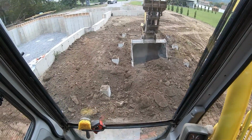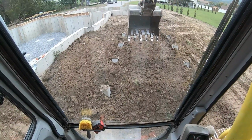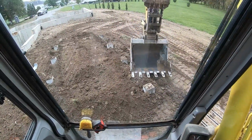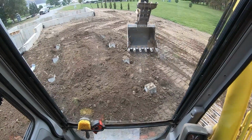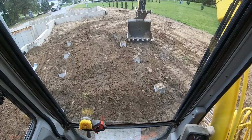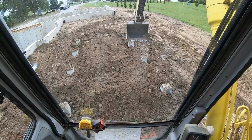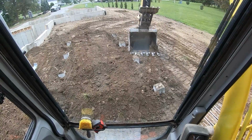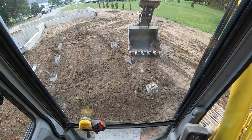Each pier, like I said, it's 3 inches pitch going down to the right, and a little lower down on this corner, this pier, for the grade, because this is the lowest point of the grade as it pitches, so kind of goes with the grade. It doesn't matter as long as you're within an inch or two with these. It's fine as long as you have uprights. If you didn't have the uprights with the 6x6, then you would get in trouble. But that's why if you have your frost coverage, they come up with 6x6s now to your joists.